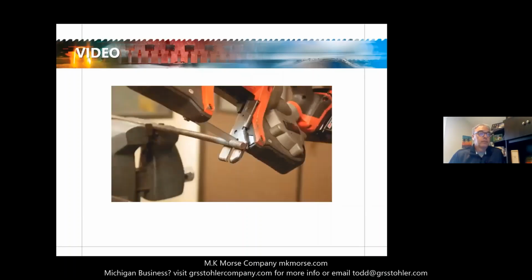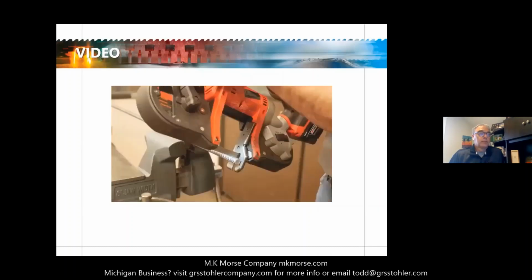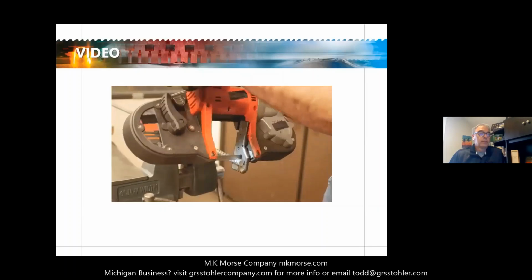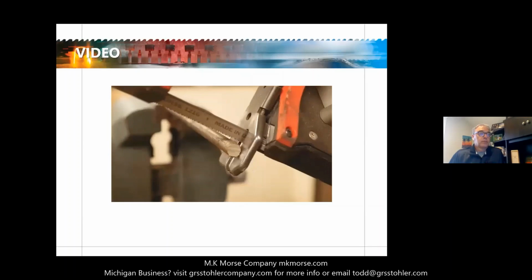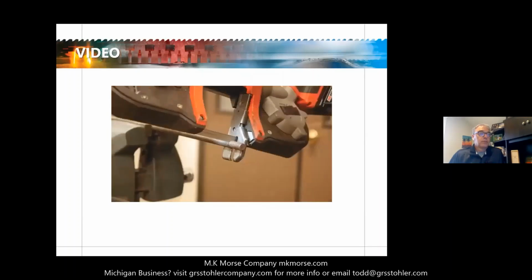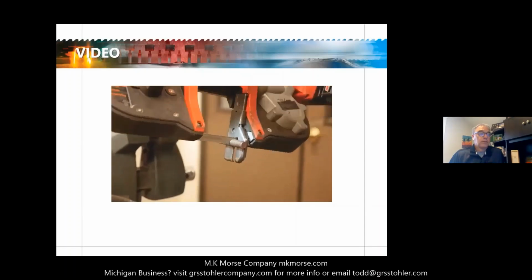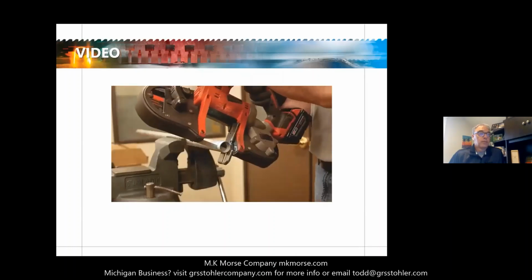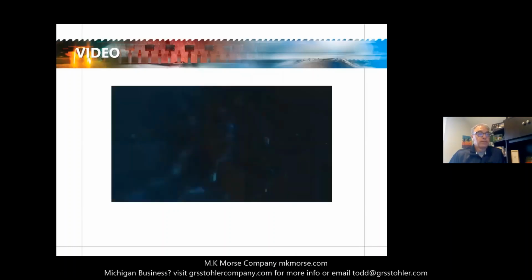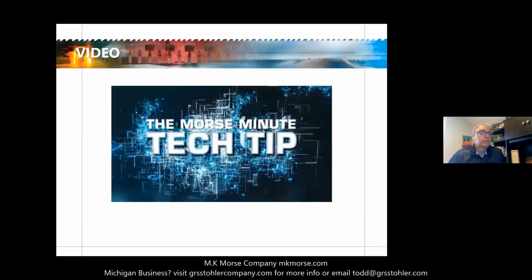The 1216 portable bandsaw blade is the sister size to the 811. It features the same tooth design, but is shrunk down for finer cuts, rated 3/16 and thinner. This replaces the common 18 TPI portable bandsaw blade. The 1216 is the perfect choice for most electrical and mechanical applications and is especially suitable for cordless, compact, portable bandsaws. Here are a few tech tips for cutting with an 811 or a 1216 portable bandsaw blade.